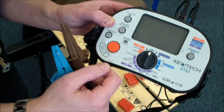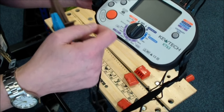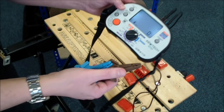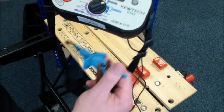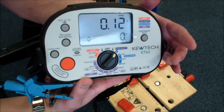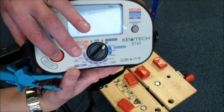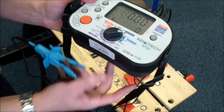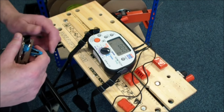The first thing to do — as we're dealing with very low resistances — is to take into account the resistance of our test leads and zero or null them out. So we turn on to the continuity setting and simply join our leads together. We have a continuity null button here, so I'll just give that a press. It tells me that my leads are 0.12 ohms. If I press my orange test button, you'll see the leads have been nulled out. Alternatively, you can just take the lead resistance and subtract it from whichever readings you get on your test.